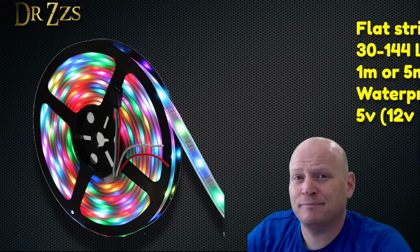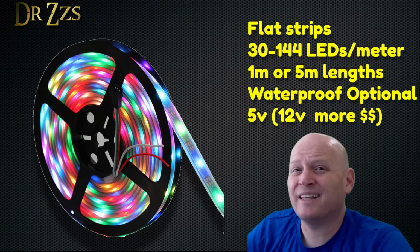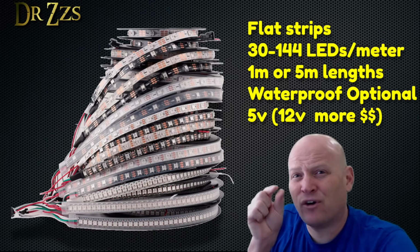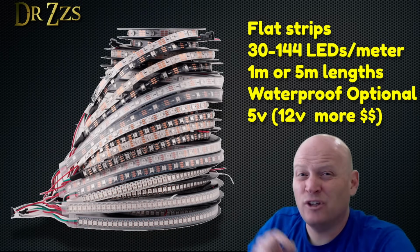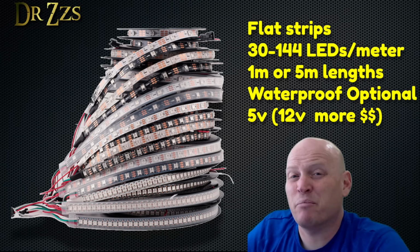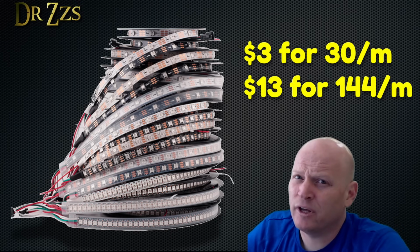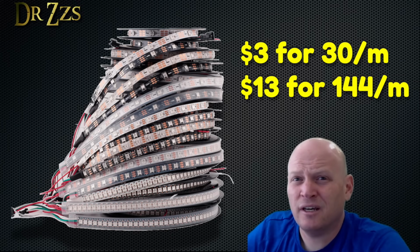The other option is strips. Strips are flat. Some are waterproof, some are not. And they come in a whole wide variety of LED density, meaning how far apart are the LEDs. You can get them all stacked right next to each other, or you can get them spaced out so that there's about 150 LEDs in 5 meters. The more LEDs you have, the more current you need, and the more expensive they are. What you choose just depends on what look you want.